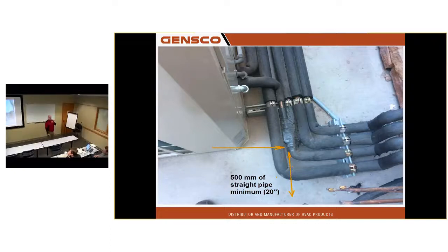So is there engineering where you can upsize the pipe? It just seems weird to put that many 90s and U-turns to make it better. Do not upsize the pipe, ever. I'm just wondering if there was some other way, it seems like that would be a better way to mix it. A better way to do this would have been to know this beforehand, actually read the book, and then set the units a few feet over there, because there was room to do that.